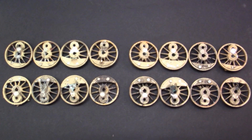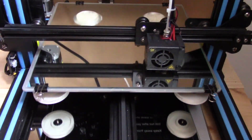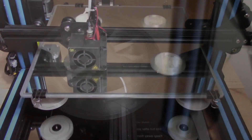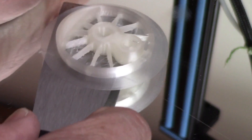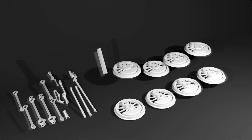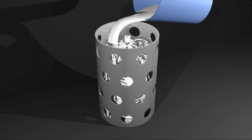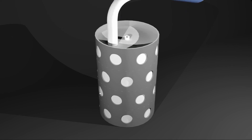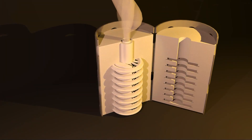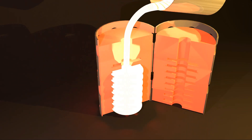A masterpiece locomotive, for example, exhibits a total of 28 wheels with seven different designs. Meanwhile, 3D printing has made its way into model making, offering the possibility to produce lost wax wheels without any master wheel or silicone form. Using a rather low-cost 3D printer, the wheels are joined together by hand to form a so-called cast tree, which is then embedded in plaster and the wax melted out at about 600 degrees Celsius. To avoid air pockets, liquid brass is poured in at about 1100 degrees Celsius in a vacuum.